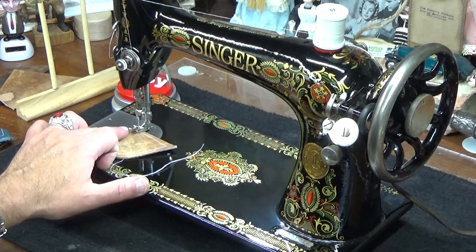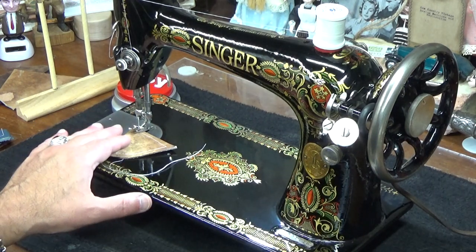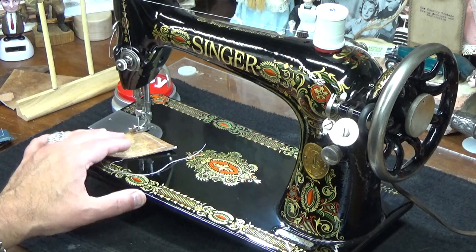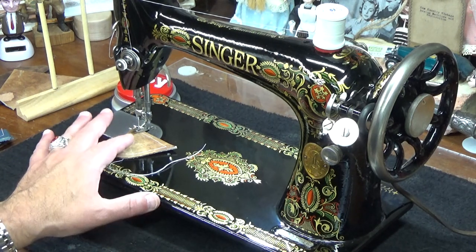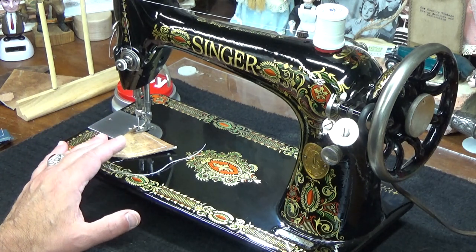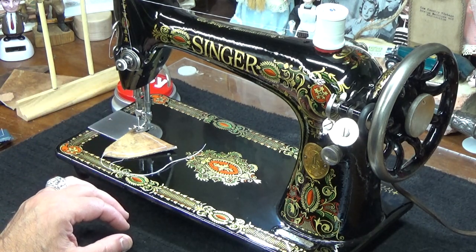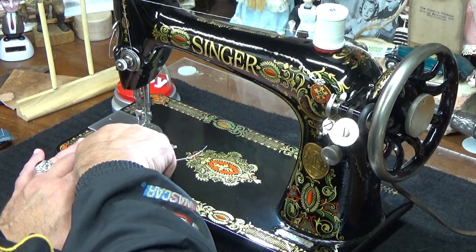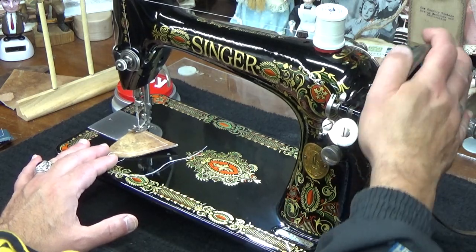See how that foot is tilted right now. That's not the ideal way to launch, but because we're already into the leather, we should get very good traction. Plus we have enough presser foot pressure that we won't slip. But if you were using this as a motorized machine, where it has a little bit more kick at launch, you may run into a problem trying to continue launching when that presser foot is up like that. It's not even. I think we'll be just fine.